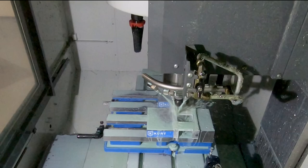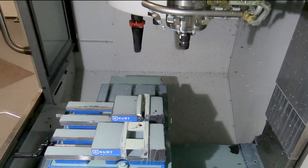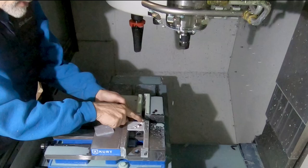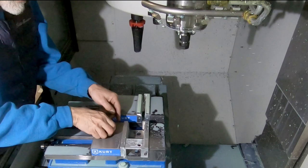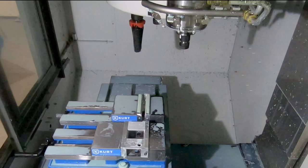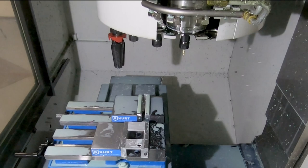And now I've got programmed into the G code a pause, so I can flip, taking the reference zero, flipping it over, reference zero over there, put the spacer back in, clamp it down with the super duper new speed handle that I just got, and then reload the quarter inch end mill and do the reverse side.